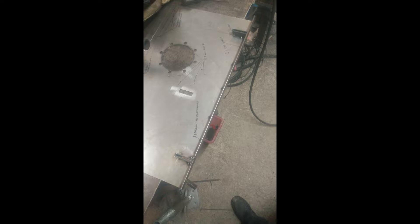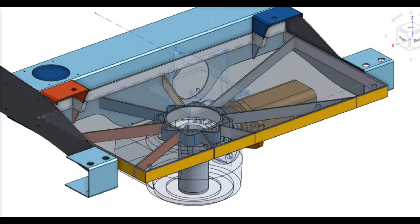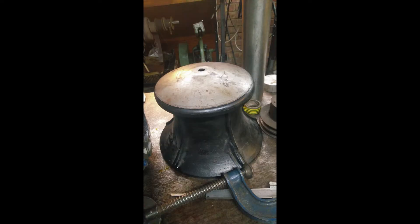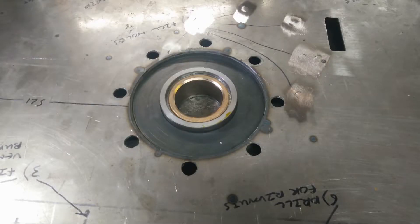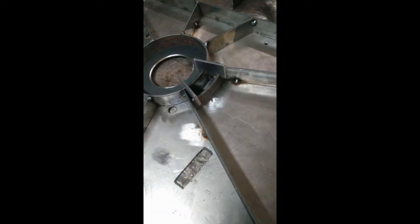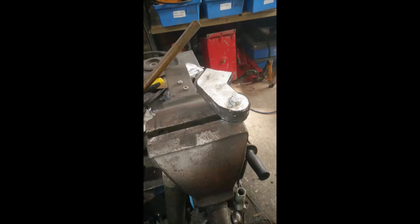With all that done I focused on the mounting plate. I could have used a thick solid plate but I didn't have anything big enough, and a 3mm plate just the right size was close at hand. A bit of CAD work to get the rough design worked out got me going. I rolled the bendy bits on a mini ring roller and pressed a few pieces like the cap for the bollard in the hydraulic press. I added a support bearing to the plate to take the side loads the gearbox isn't really designed for. The support consists of a mehanite journal on the main shaft which runs in an oilite bushing pressed into a chromoly housing in the plate. The gearbox locates on the plate with an interference fit collar and gets retained by 8 M10 bolts, with an extra row of support ribs acting as crush tubes and ribs running to the edges making the whole plate very rigid. The fairlead is made from more scrap bits and bobs — the supports are shaped with the plasma cutter and grinder and get secured to the plate with fitted M8 bolts and captive nuts.